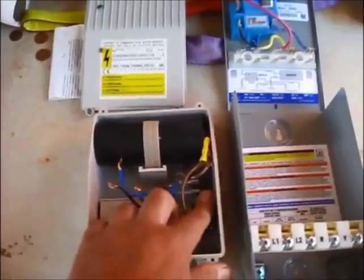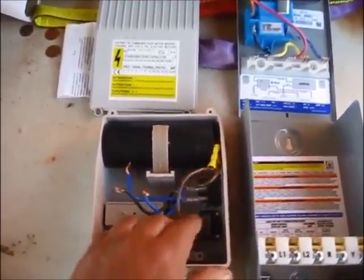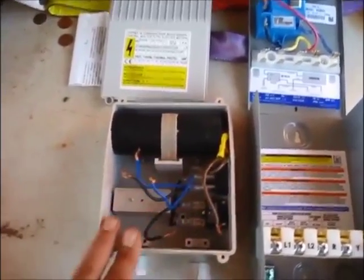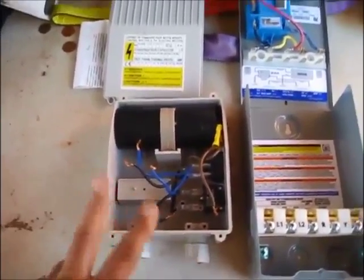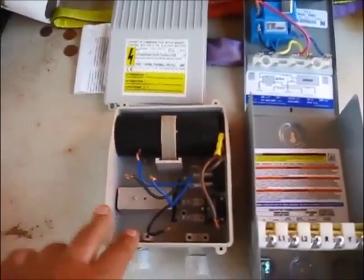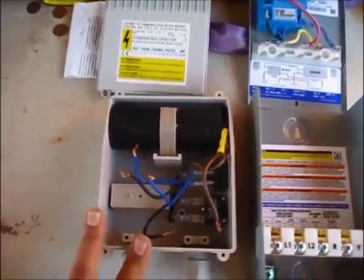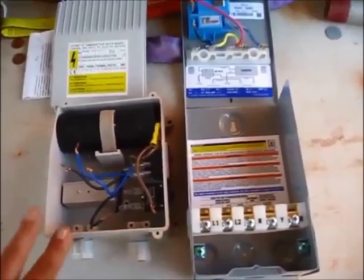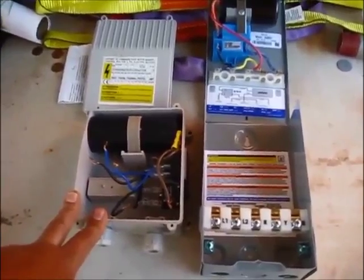The quality of the double-pole single-throw switch, and the fact that there is a single circuit breaker on one leg alone — that's just going to cause problems if one leg cuts out and the other continues to feed. Those sorts of things tell me a lot about the thoughtlessness put into a product like this. Lesson learned: sometimes when you try to save a few dollars you end up short-changing yourself, when you should have paid the money and gotten something more reputable — a lot more reputable — because the quality is going to last you.